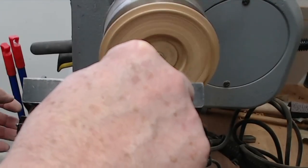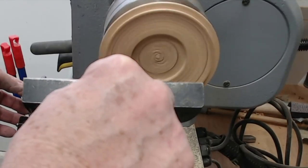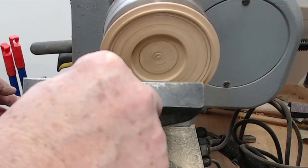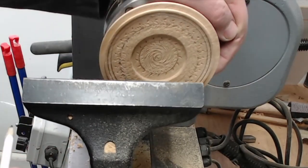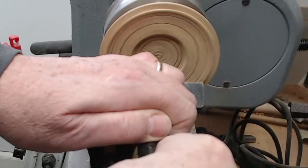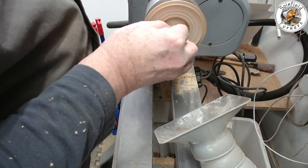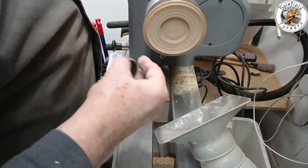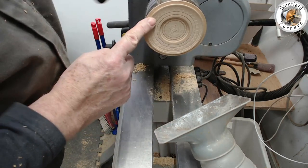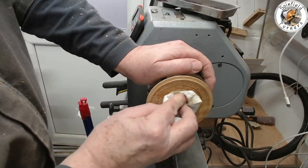It's not always easy to see the gap between one pattern and another, so it's quite a good idea to mark out where you want to cut with the point tool using a pencil first — it avoids ruining the pattern you've just put on. Then a quick sand to de-nib from the texturing, which raises the grain a bit, and then some hard wax oil.